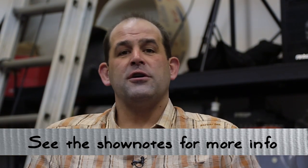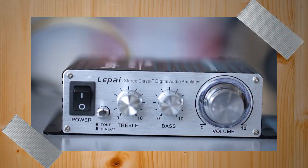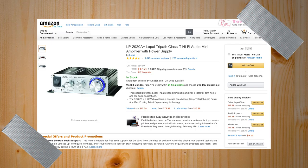Jesse, go with 8-ohm speakers. Basically the lower the ohm rating, the harder it is for your amp to drive it. You're probably going to use an inexpensive amp for this project because it's got to fit inside a suitcase. I would suggest car speakers — the more efficient the speaker in terms of SPL rating, the more sound you're going to get out for a given wattage. Look for something closer to 91 dB rather than 85 dB, or just find speakers in your house or strip them out of an old speaker. Somewhere around here is a Lepai T-Class amplifier — they sell for $15 to $19 on Amazon. We've talked about them on Tekzilla and they're pretty impressive, especially for the price. They sound good, they don't cost much, and they'll fit easily inside your case.